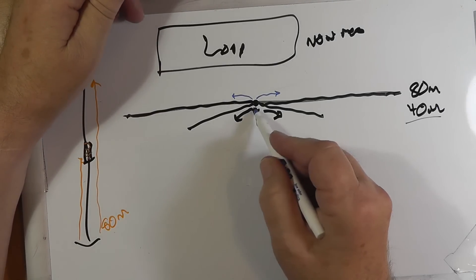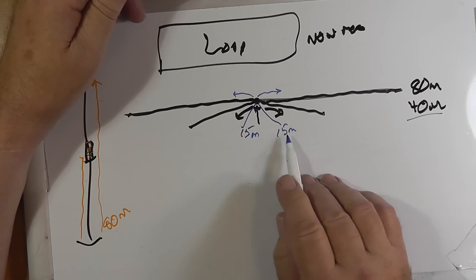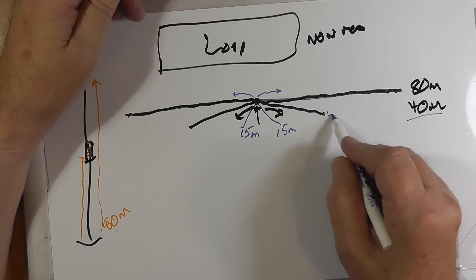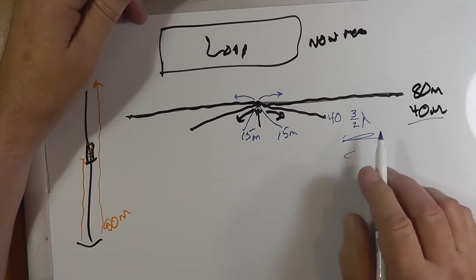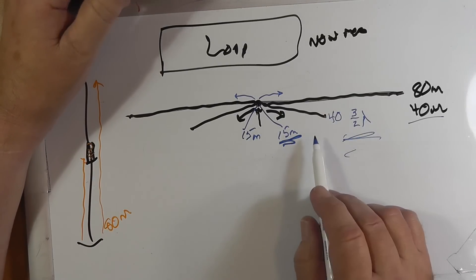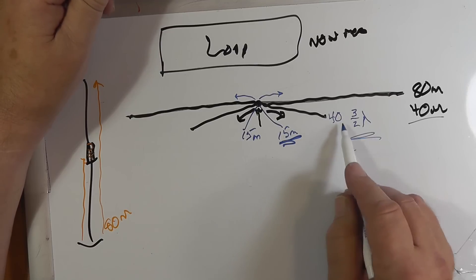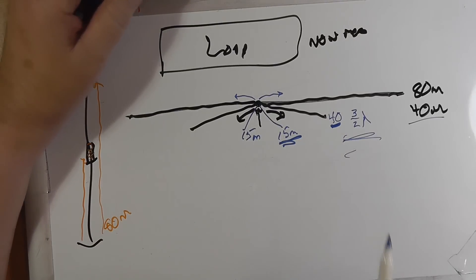That works, but there's one place where it's a little different. Say you have a 40-meter antenna and you put a short antenna there for 15 meters. It turns out the 40-meter dipole is a three-halves wavelength at 15 meters — lambda stands for wavelength. You can actually skip the 15-meter antenna in a multi-band setup, or include it, because the 40-meter antenna comes very close to wanting to resonate at 15 meters as well. Some of your radiation goes out on 40 meters and some on 15 — that's the only case where you get that harmonic-type relationship.